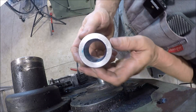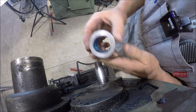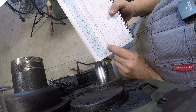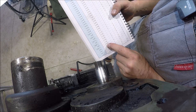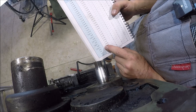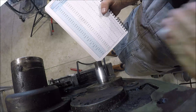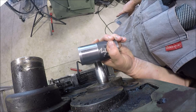There's Prussian blue in there and we've got contact all the way around, so I think we're pretty much the best we can be. The book shows 1-in-5 at 200 thou, and 1-in-5.5 at 0.181, so it may be that — I've only got a difference of about six or seven thou measuring it. It fits pretty good, so I'm just going to leave the compound as is and go ahead and use this piece. I'll drill it, cut the taper on this side, and grip it. That's where we're at — let's get back to throwing some chips.